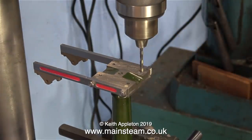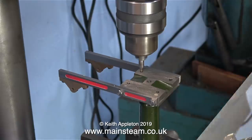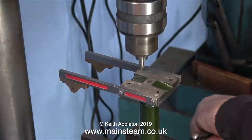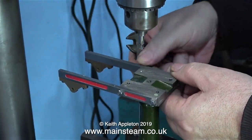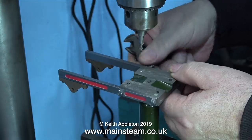Once I've deeply centre-drilled the holes, it was time to change to a 5/32nd of an inch twist drill, which is tapping size for 2BA. This job is not as easy as it looks — I'm drilling into cast iron next to steel, and thankfully because I've deeply drilled with the centre drill the bit isn't wandering. Either way I have to be very careful and very gentle. The last thing I want at this stage is a broken drill bit in the hole. I then remove the entablature because the bolts holding it to the main column are quite long and may get in the way of the hole I'm drilling.